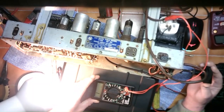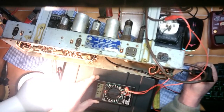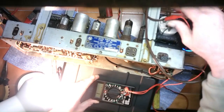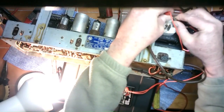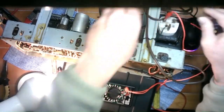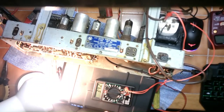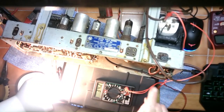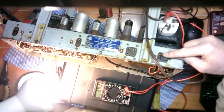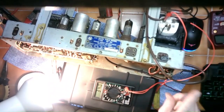Now you can see the actual switch knob and the selector switch and mains control. If I switch that on you'll see it switches on. I've got connections onto the plug terminals here, which are a bit tarnished brass. If I flick the switch off we go open circuit; flick the switch on and we get 34 ohms — that's the mains primary. I've tested the other windings and get various readings, none completely short circuit, covering the different voltages available.